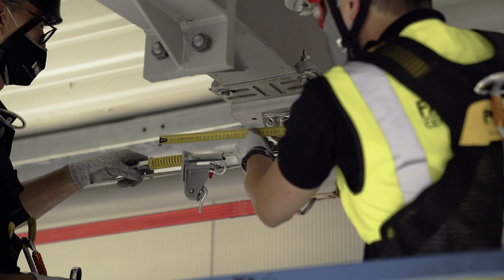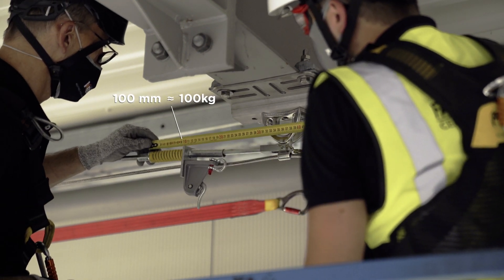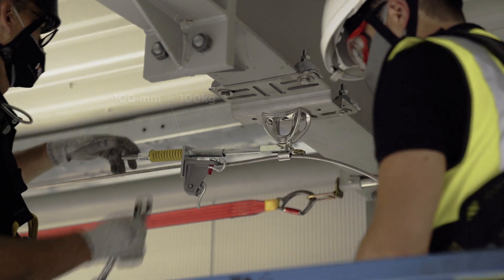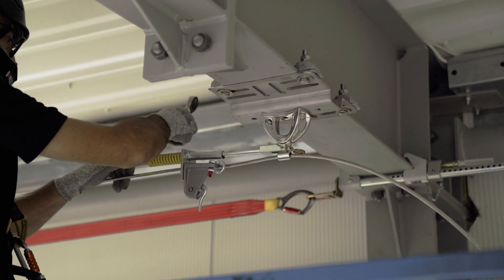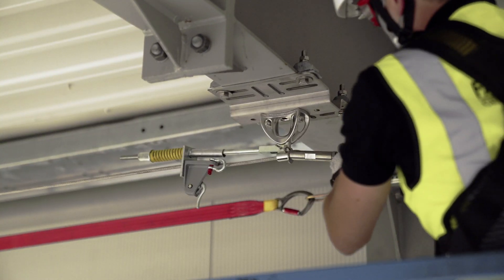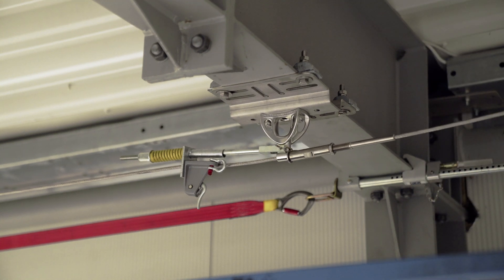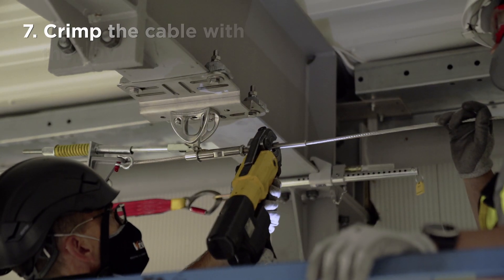Use a 19 key to tighten the bolt and put tension on the line. You can verify the tension by measuring the compression of the yellow spring. The recommended tension is 100kg, equivalent to a spring of 100mm long. Place the tensioner LDV-137 against the end anchor LDV-002. Crimp the tensioner six times.